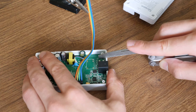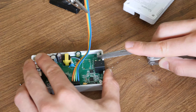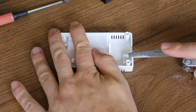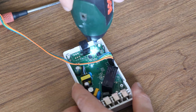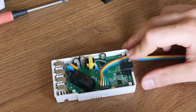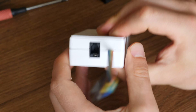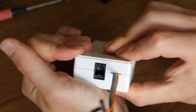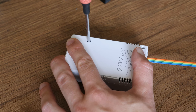Now use a file and remove about a millimeter until the edge. Do the same thing on the other side of the housing. Put the PCB back into place and insert the four PCB screws again. Now put the two pieces of housing together — the rainbow cable should have just enough space. Forcefully insert the remaining four screws again to finally close the housing.